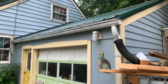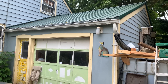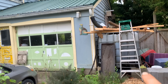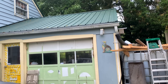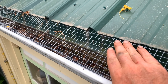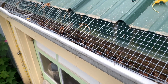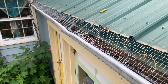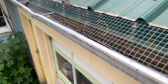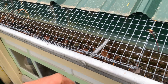I made a video a ways back about a very simple homemade gutter screen. You can see it here on the north side of our garage — it captures and sends water into this tank, which equalizes amongst three tanks. This is half-inch hardware cloth cut with tin snips. It's straight on one side, goes right under the roof metal, and is folded over on the other side so it kind of clicks into position. That mesh has worked pretty decently for filtering the bulk of debris — leaves and twigs tend to shed over the top, though there's a fair bit of gunk in there.